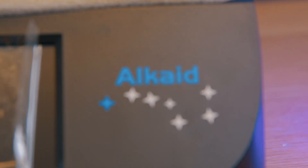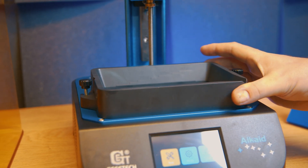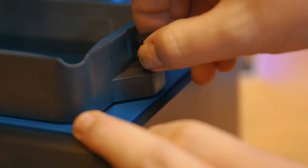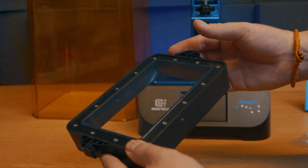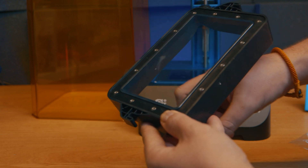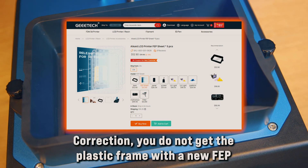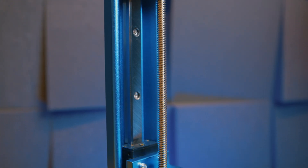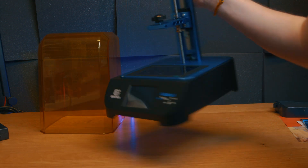But back to how cheap it is — the whole chassis is plastic, and so is the vat. Not only is it cheaply plastic, but just screwing this into the body of the printer can be a bit of a pain, because there's not enough clearance around the bolts to fully turn them, because they sit below the top of the vat and your thumbs get in the way. The release film is clear FEP — it's old FEP, not the newer N-FEP or PFA, which lasts a bit longer. And replacements for this are only available from Alcade, because they ship the FEP with the plastic frame already on it. But that does make changing it a lot easier. The Z-arm has a single linear rail and a traditional lead screw, so you may experience some Z-wobble in time, but I had none in my limited testing.